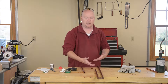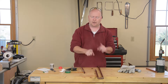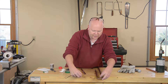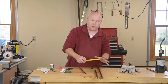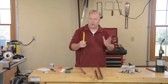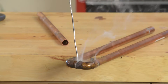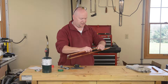I have the first two halves of my upright sections and the bottom all prepped and ready to be soldered, but I'm not quite ready to put the heat to it yet. It's pretty important that the two uprights are in fact parallel, so take your time, bust out your tape, and make sure they are as parallel as you can get them before you solder that bottom joint. It's copper — it will bend a little once stuck together — but it's better to get it right at this point.